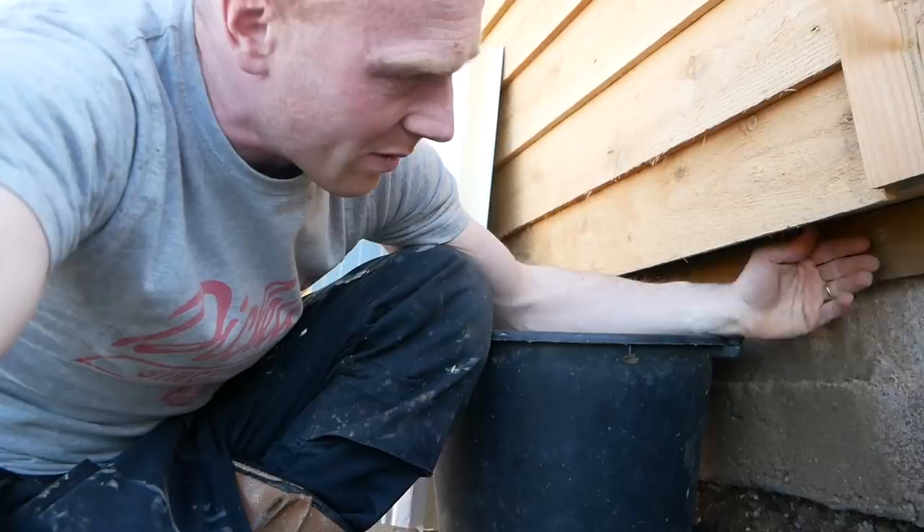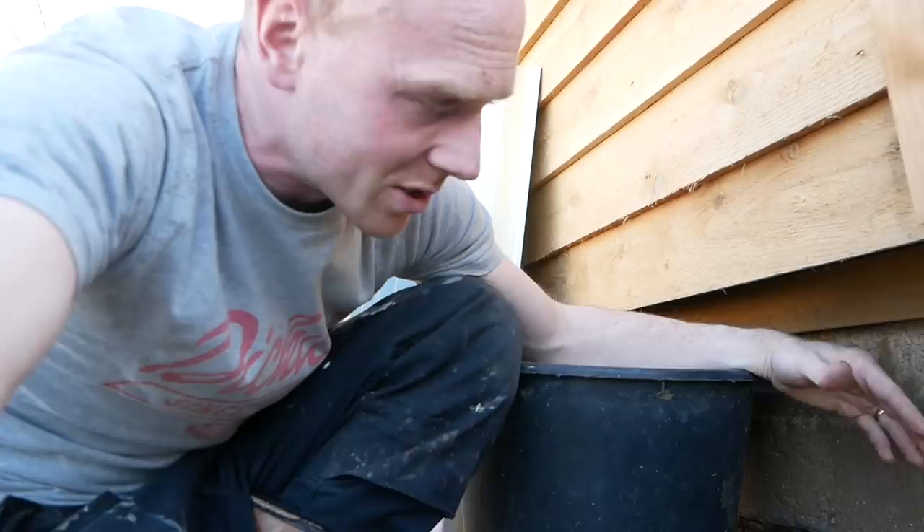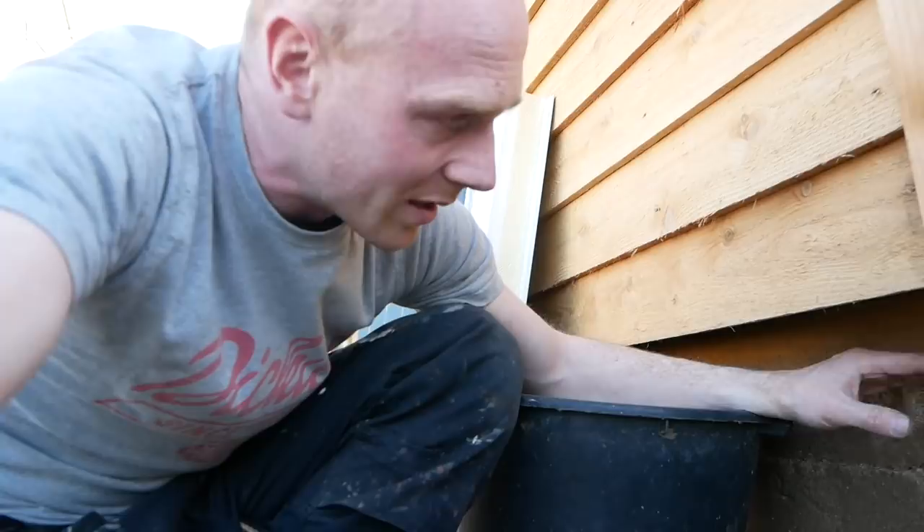The way I did the concrete was essentially a bit like a raft - so it's much thicker at the edges. Because we've got sloped ground here, you can see down in this corner it's about 300mm thick, and that's just where all of our timber frame is bearing onto it. It would have been fine if it was a level surface to leave it at four or five inches, or 100-125mm. That is probably the thinnest it is in the middle, but then it just thickens out near the edge.